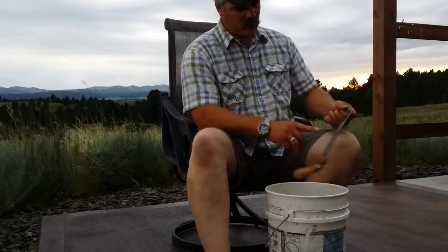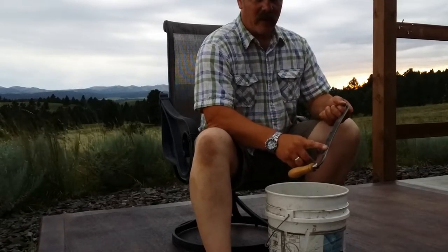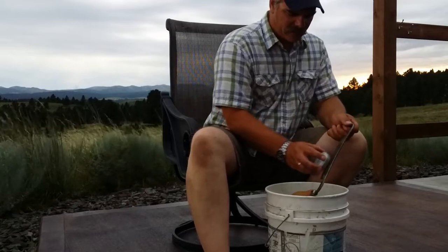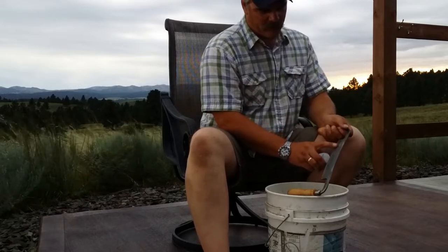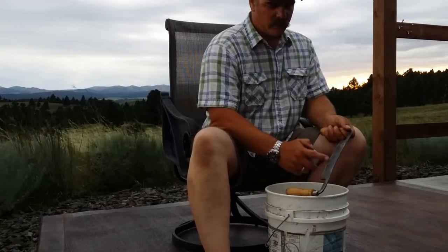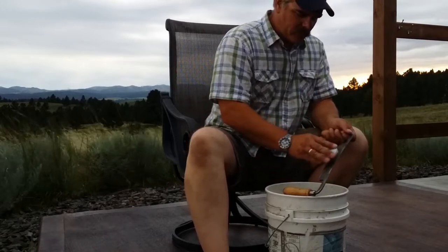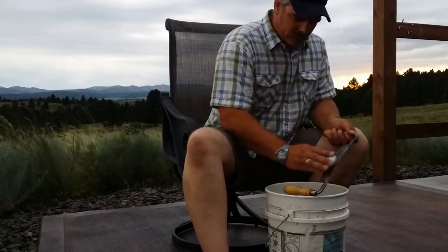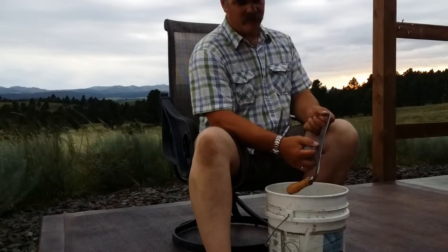As far as the back goes, the back is concave — it's deeper in the center than on the back and on the edge. Some guys try to get that back completely flat, but I usually don't. I'm usually just riding on the bottom edge here, making sure that's flat a decent ways back from the edge. Then same thing on the back — circular motions, trying to get the first half inch or so flat.